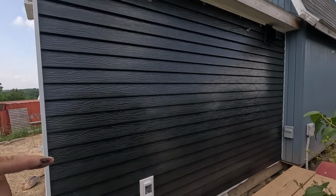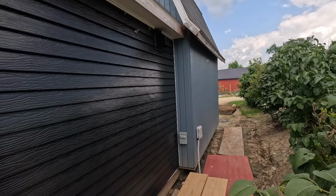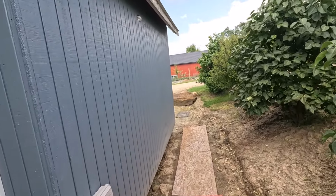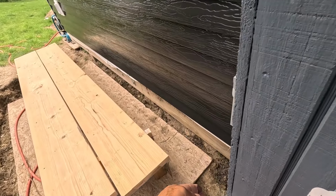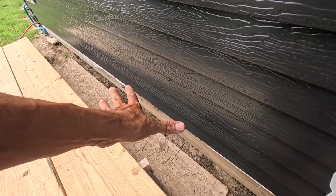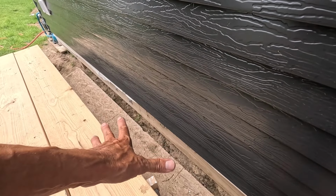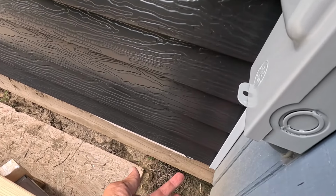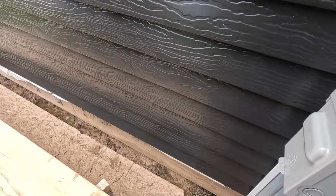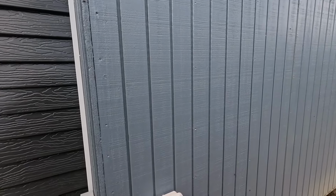But before that, I'll be putting in the air conditioner stand and running the line from this hole here. We're going to go down and then underneath the building and then over, and then it's going to come up and go into the mini split compressor unit, which is going to be right here. This had to be done before I could do that. And then we'll have watertight electric cable coming out like that and connecting to the unit, and bada bing bada boom, we'll have a good deal more coolness in there.